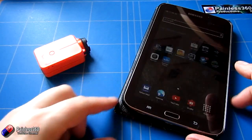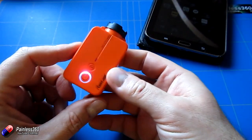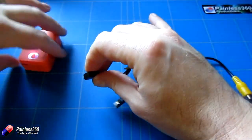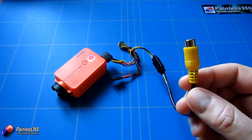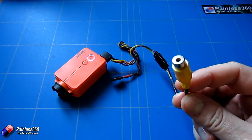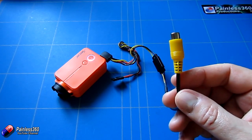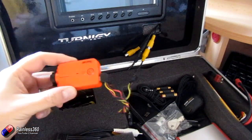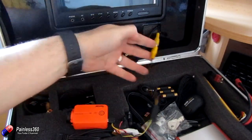What you really want is access to all of the features of the camera. To do that, turn Wi-Fi off and plug the cable into the back of the camera, then plug in your RCA connector. If you have it connected to your FPV system this is how it'll be connected anyway; otherwise find something with an RCA jack. Here's the Runcam connected to the ground station — the AV out cable connected into the RCA adapter that came with the Runcam, connected into the ground station.